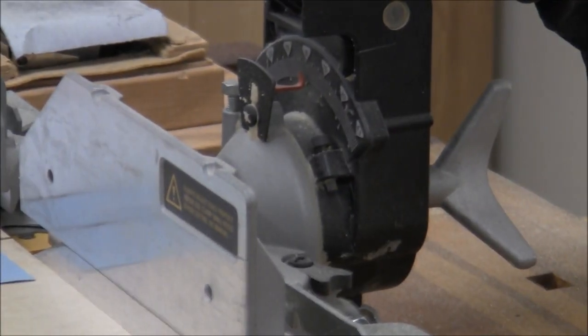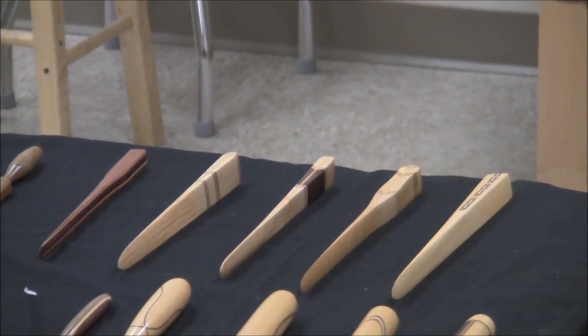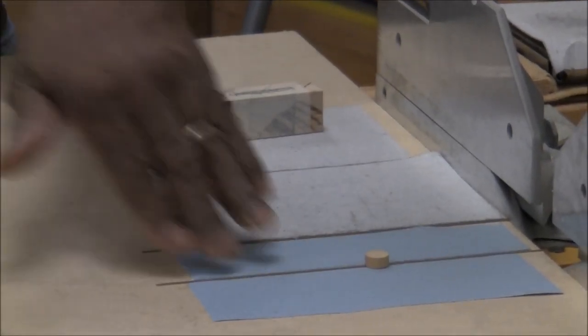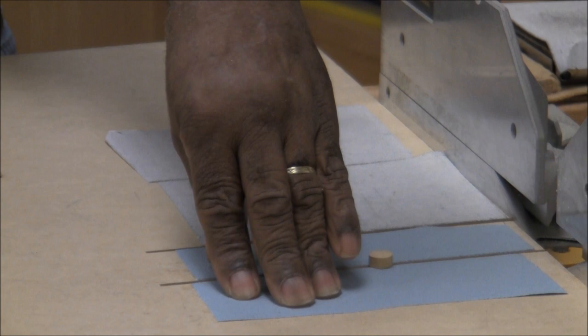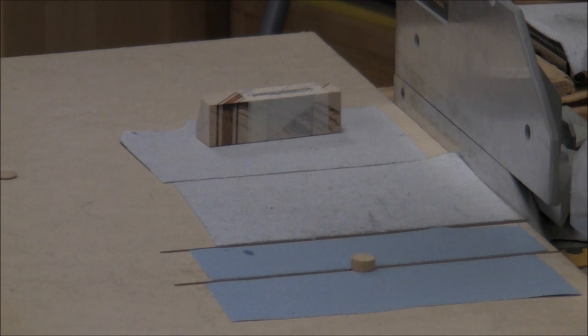The other thing is I want to make sure the saw blade is not going to cut the tip of this, because I have sandpaper on it. The sandpaper on the tip gets worn down. That's when I'm cutting a bigger piece and need a little more grab, but you only need sandpaper right here. The only thing I've done that allows me to cut in the middle is create a vise to hold this piece of wood. The sandpaper is what's holding it, applying pressure to keep it adhered. That allows me to cut in the middle of the table without it snatching. That's plain and simple.